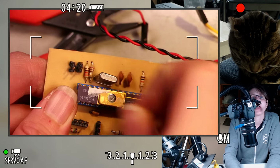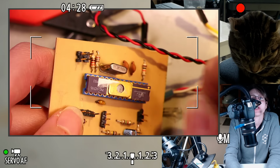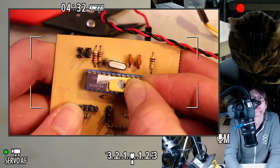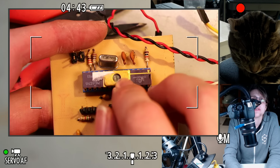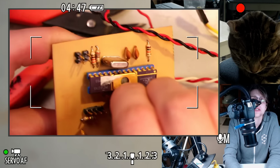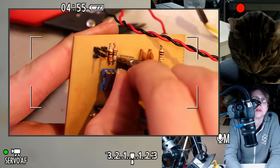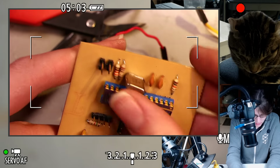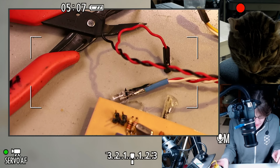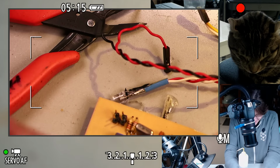This is a really interesting packaging technique that was pretty archaic even at the time this chip was produced. So the package was ceramic, and there's this, I guess it's gold plated, I don't know what the base metal is, but this window. And the metal surround for the window is made out of some kind of metal, and the window itself is made of quartz, so the UV can pass through it. So as you can imagine, these chips are more expensive than something you'd usually want to ship. I think each of these individual chips was maybe like $7 or $8 at the time. Whereas, they were designed to be something you'd put in really mass manufactured products, so you wouldn't leave the windowed version in for any longer than you had to.